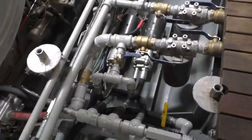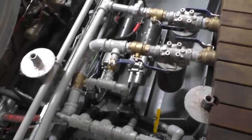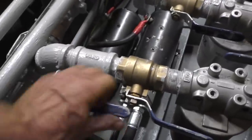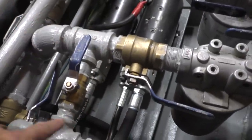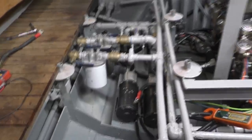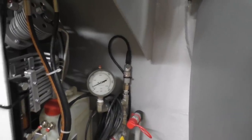Put a piece of tape on there to mark where the oil is. Nothing on the gauge — stop, I see a problem. You've got to open the valve that supplies oil to the pumps. That's our problem — so they're running dry. That sure sounds different. Gauges coming up. It was all movement — so we've got some pressure. Let's see what we did.